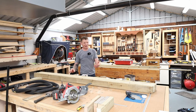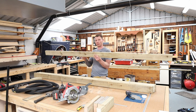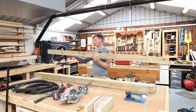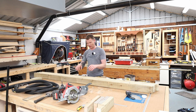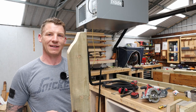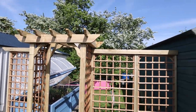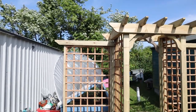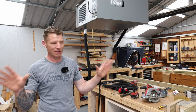I want to replicate what I did with the top of the arbor — just a smaller version. The plan is to put a four-by-two on both sides to replicate the six-by-two, then cross it with some four-by-twos. I've cut them to length and put the same detailed curve cuts in the ends just like the arbor. After screwing one on both sides, I decided that's where I'm going to leave it — less is more. Let the arbor be the centerpiece and the screens just frame it off nicely.